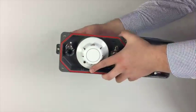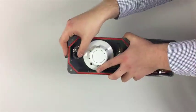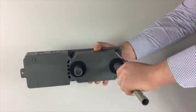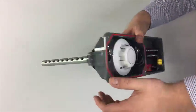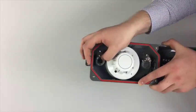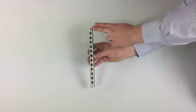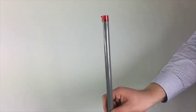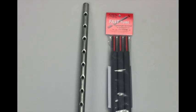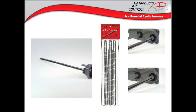Sampling tubes can be front or rear mounted. The tubes have a notch which indicates where the sampling holes — or in this case the fast tube sampling channel — are located. Once the installer determines the position of the airflow, they insert the tube into the duct so the airflow flows into the holes or channel. Once they rotate the spring-loaded retainer, the tube is locked into place. No additional filters or screens are required. The tubes for the SL2000 are offered in either the standard metal tubes or the fast tube sectional sampling tubes. The metal tubes come in lengths of 10 inches, 2.5 feet, 5 feet, and 10 feet. The fast tubes are sold as a bag of three two-foot sections that can be connected together for the length needed.